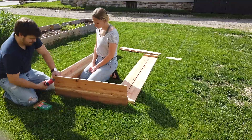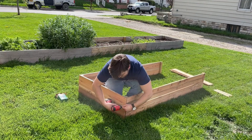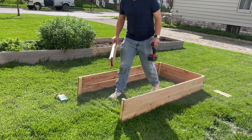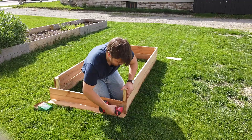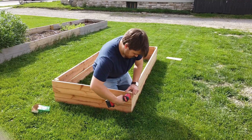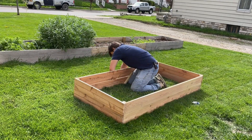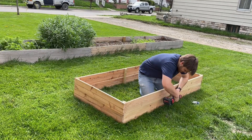It's easy to have an extra hand. Go ahead and do that on the other side. Once you have them screwed in, it is really sturdy and easy to keep going as one person. Last step is we're just going to screw on that last side. We've been using some of the fence boards to help keep a solid ground underneath and keep things square, but you don't have to do that. Then once you've put all of those screws in, you have your whole box — but we do want to put in some side supports. Using your last two 2x2 sides, screw those in just in the middle of the length so that it keeps it sturdy and keeps it from bowing. And that is it.